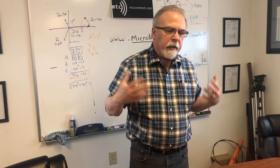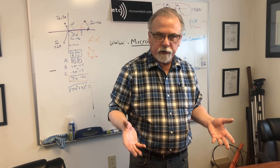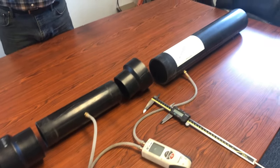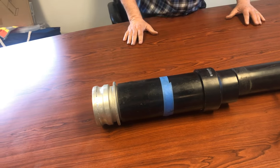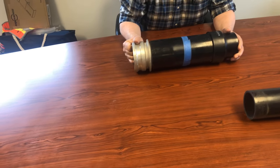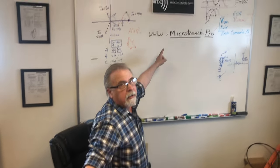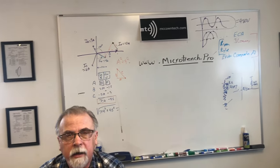What I finally ended up doing was this Venturi tube design, which is very well known and well characterized in the literature. And it's simple — you can get all these parts at a Home Depot. These are all just ABS drain, waste, and vent pipes, and I'll be posting a full set of drawings as well as this video on the website.